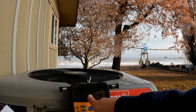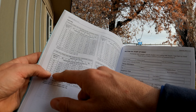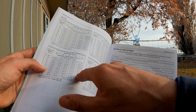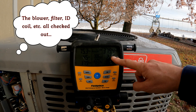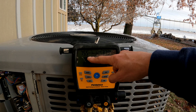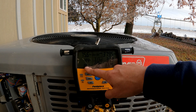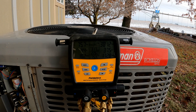Literature: three-ton heat pump, heating mode. It's 30-31 degrees outside, so we'll go with 30. I'm not exactly sure what it is inside, but subcooling should be about 24-25. I think it's about 65-70 wet bulb inside, so between 65 and 70 — so 24-25 subcooling. This thing spiked back up again, we're about 38 subcooling. Superheat looks normal, so I know the TXV is feeding as best it can. It's fluctuating but under 20 anyway. Vapor saturation on the low side: 18 degrees — it's 31 out here, so that looks pretty good. I think we're just a little overcharged, I'm gonna pull some charge out and go from there.